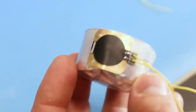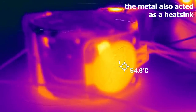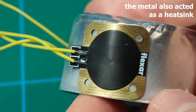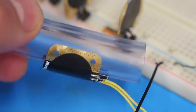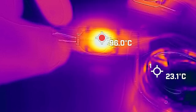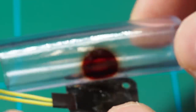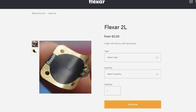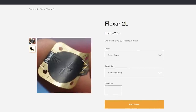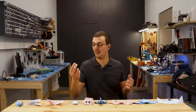I did test a couple more samples that were banded. Two samples were connected to a 38mm diameter can, and both survived a month without any problems. The other two were connected to a small diameter plastic pipe, and I think the bend radius was too small — with time, the coils got peeled off. It also made a nasty burn to the pipe, so its material is not rated to go to 100 degrees. I turned this PCB actuator sticker into a kit, which you can now buy from my website for just 2 euro.